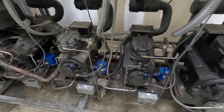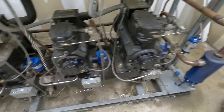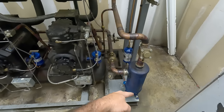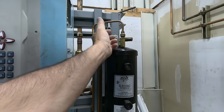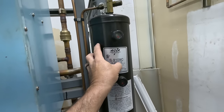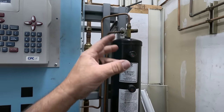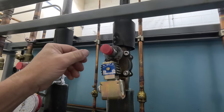When we get back here we'll have to shut everything down because we've got oil coming through each one of these pots on the side. The way it works: you have an oil separator that separates it, and as it gets high enough, the float rises and blasts that high-pressure oil through the oil filter into the top of the oil reservoir. There's a 20-pound check valve — it puts high pressure in, and when the ball shuts, this check valve allows it to drain off that extra pressure back into the suction header, keeping it about 20 pounds above suction so it can push oil into the oil floats.